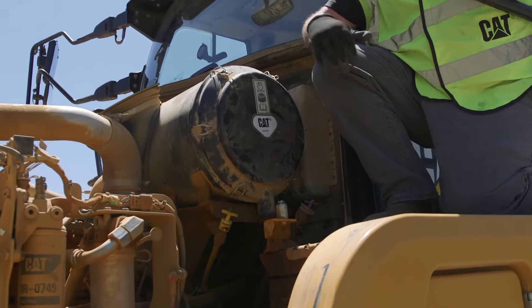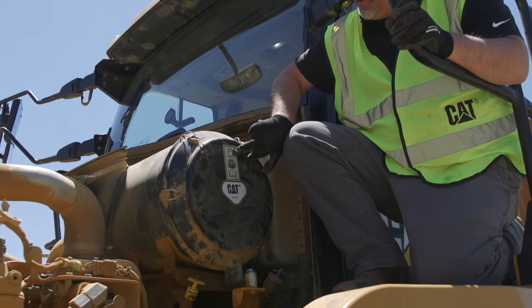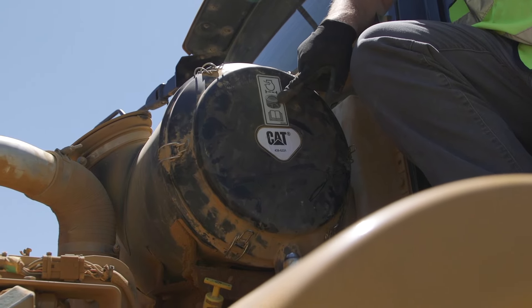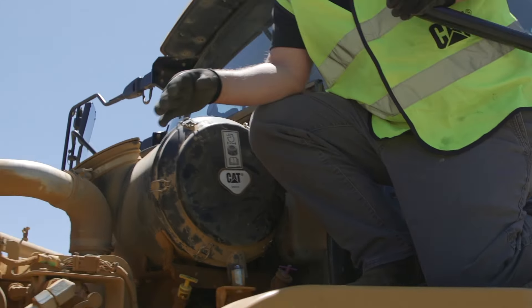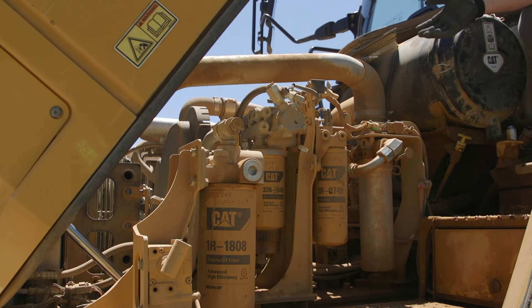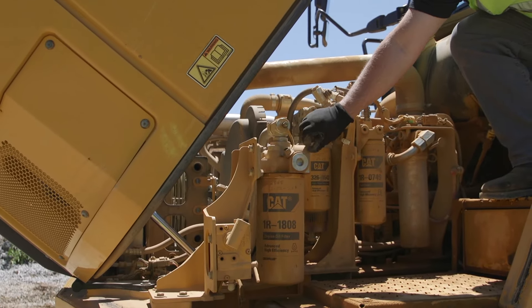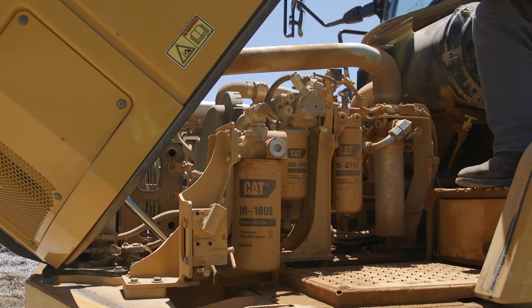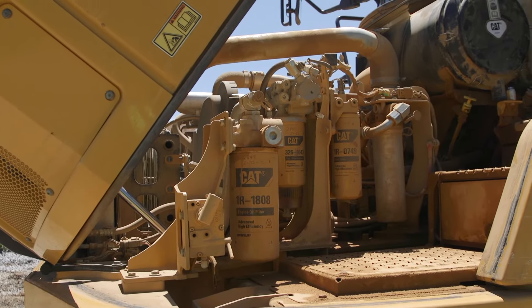We can pop these clips, pull that air filter out, and keep it clean. It's also got our ISO symbol on there — it gives me a primary symbol showing an engine block with a big arrow going in showing air intake, and that dashed line underneath always represents filter. So that symbol right there is telling me this is the engine air filter. Also a good opportunity up top to look around and make sure there's nothing going on with that engine — whether it's a broken line, leaks coming out of my filters, or anything like that. We also always want to pay attention to the SOS sample ports. I always want to make sure those rubber boots are in place, as in the environment we're in they could get loose and bounce off.